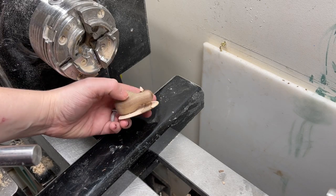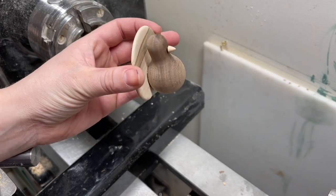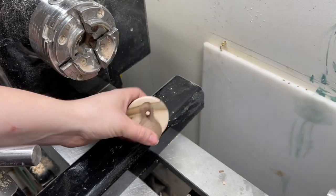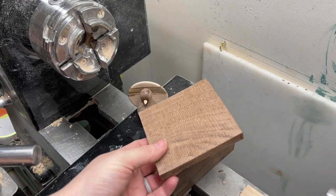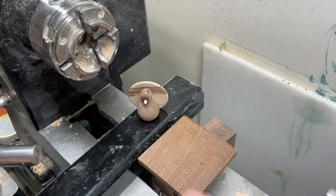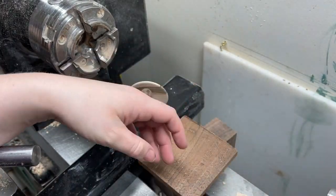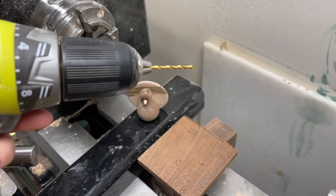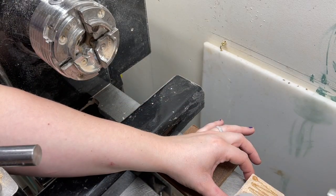I'm going to show you how to turn this style three-piece turkey. I kind of got this design from my penguins that I make — there's another video online of how to do those. You're going to need a spindle blank for the body, some sort of board blank for the tail, a spindle blank for the beak, some sort of glue block, some sticky block, some glue, a drill and drill bit, and then I'm just going to start.